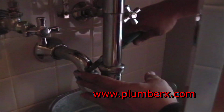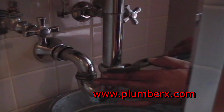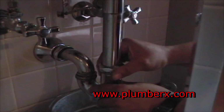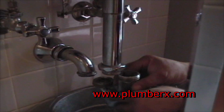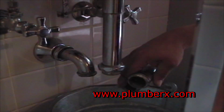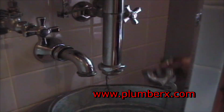And what we like to do is to get a small bucket to catch the water that's still trapped in the P-trap. Once we remove our P-trap, so we don't get any water on the floor, we just take this apart with our channel lock pliers. And also, this is a good way to unstop a clogged sink, because sometimes the stoppage could be right there in the trap.